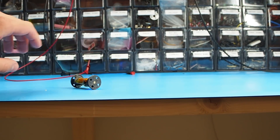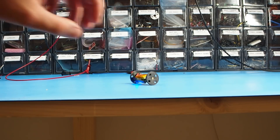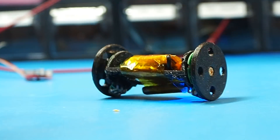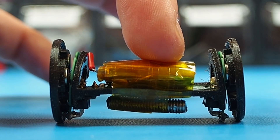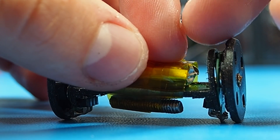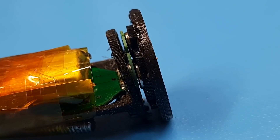In all these tests, I was driving the two wheels at the same speed, so the robot should always have been moving straight. But sometimes it was doing unintentional turns, which was probably happening because of the wobbly wheels. I thought it was going to be okay using 3D printed PLA wheels, but with time the bearings and magnets just started getting loose, and the plastic holder also started expanding with heat.